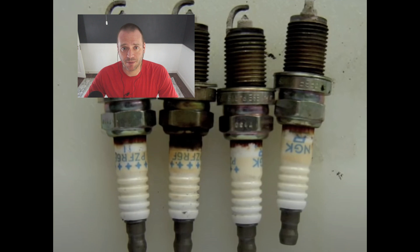With the cylinder looking fine, that was a relief. Some more research found that the discoloration of the spark plugs is actually a normal phenomenon known as corona stain — it's caused by static electricity and is of no concern. NGK has a short YouTube video explaining it, and I'm posting a link here for you. With that, we replaced the spark plugs and kept investigating.